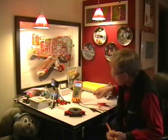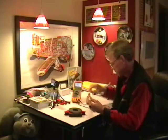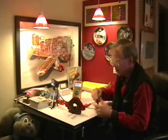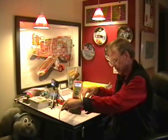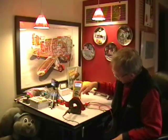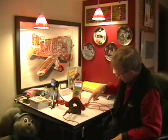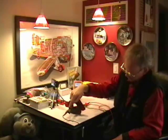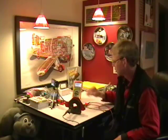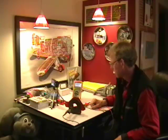With the meter set on millivolts, I'm going to hook one end up to my conductor, then put my conductor through the magnets. You don't actually have to have magnets with a hole — we'll look at that after I try it this way. Then I'll hook the other end of my leads up to the other end of the conductor. Now I have a circuit that goes from the meter through the conductor, which is passing through the magnets, and back through the other lead to the meter.